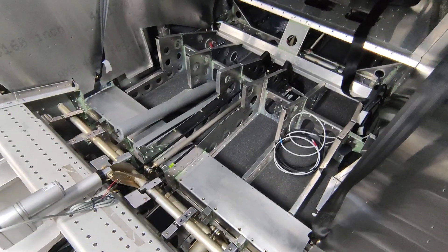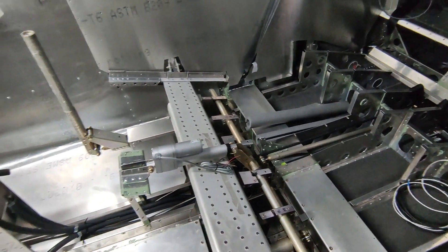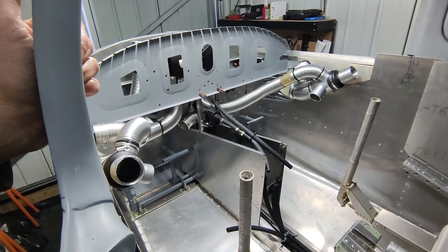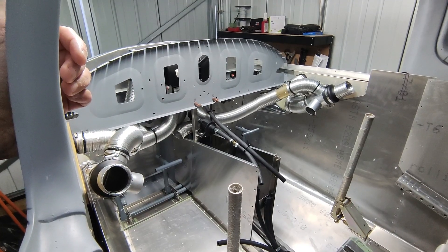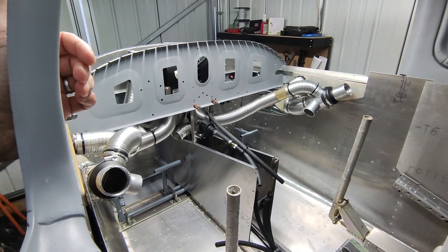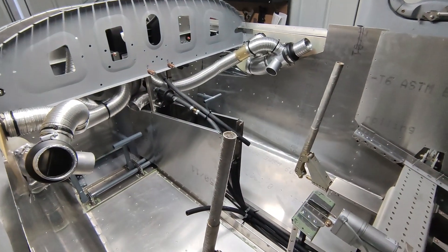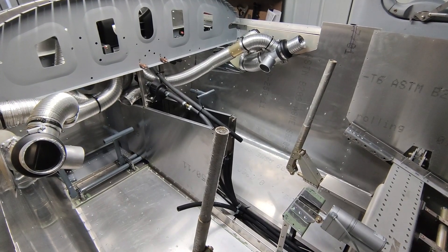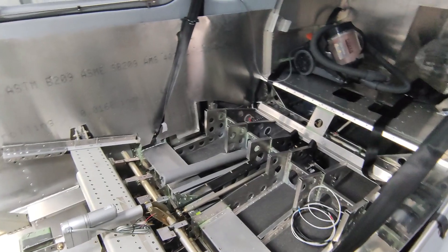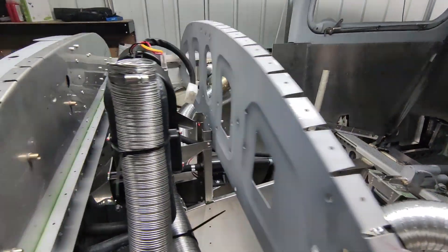As for further work, still waiting on the avionics harness to arrive. There was some delay because a few components needed to be added to meet UK CAA requirements for IFR flight — specifically a certified altitude encoder had to be added, and a few changes were needed to the buttons on the control stick. That's all done now, and hopefully the harness will ship this week so by next week it can be laid in and the build can move to the paint booth. That's it for this time — take care everyone.